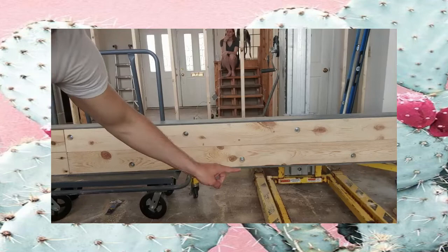You can tell they packed it with wood and there are rods going through it. They needed to pack it because all the old joists in the ceiling will need to connect to it, and on the other side the drywall will need to go into it. Otherwise it was just a regular I-beam and you couldn't attach anything to it. They countersunk the screws so drywall will go flush with it.